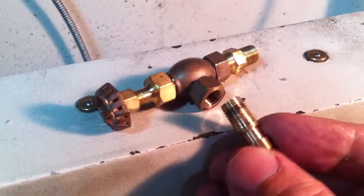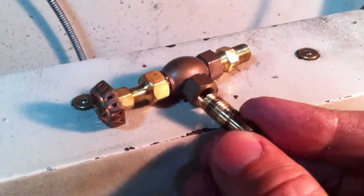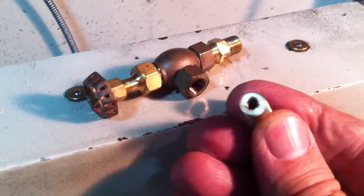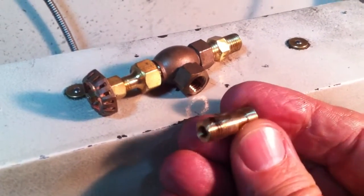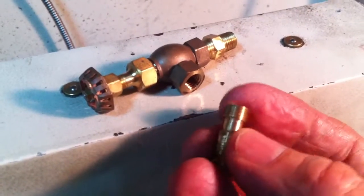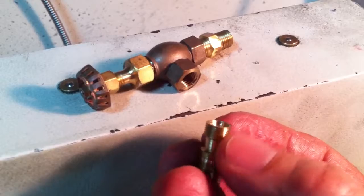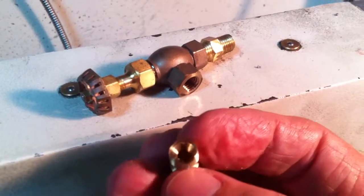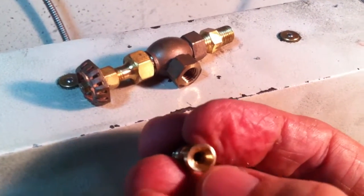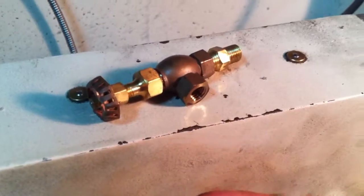As you can see, this long end has the little magic marker line on it. That is the 1/16th inch pipe thread — it's got a 1/8th inch hole drilled right through it. Then I made a little shoulder for clearance for the nut, and then this part is threaded 5/16th inch 40, which is a model engineer thread, and I cut the 60 degree cone in the center with a large countersink.